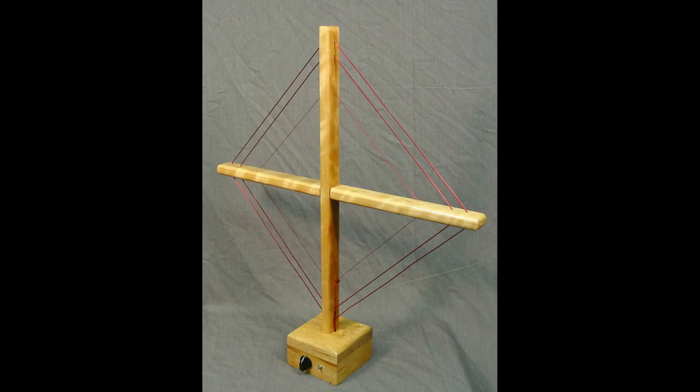Here's another one I think made out of cherry. Notice there are several windings on it. The smallest winding in the middle is the coupling loop that goes to a PL-259 chassis mount on the back. The other loops are switchable by a little switch in the front — they go either in series or parallel. In series it covers lower frequencies; in parallel it covers much higher frequencies. The actual tuning to the station you're interested in happens with the knob on the front.